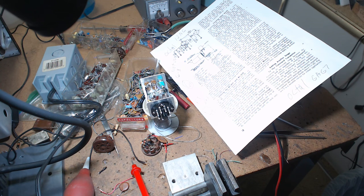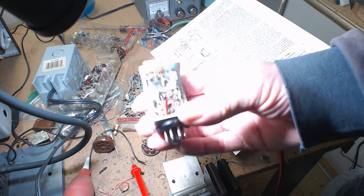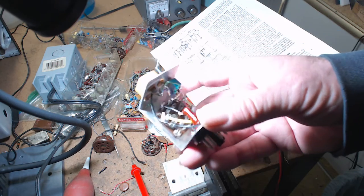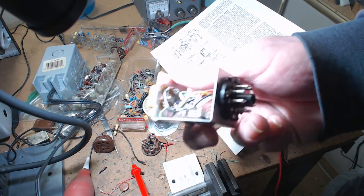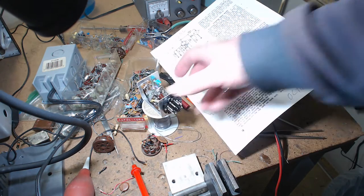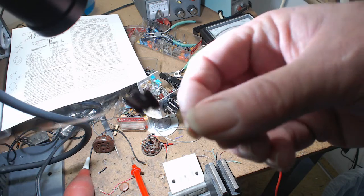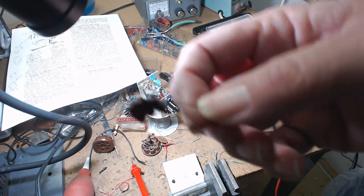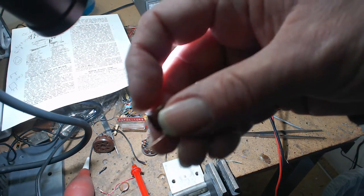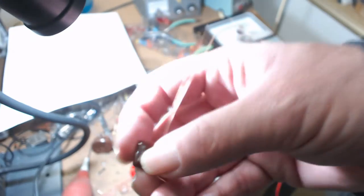Like I said, this video is for the two people that tune in to see how this is coming along. The switch is all wired in, the two crystals are socket-wired in, and there's not a lot of room in there. I have to parallel some capacitors — these go in the grid circuit, low voltage so if they short out no fire will break out. The two big silver micas — 53 picofarads each in parallel — go up in the plate circuit as 100 picofarads.